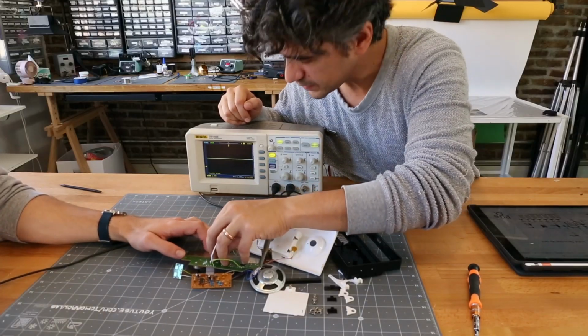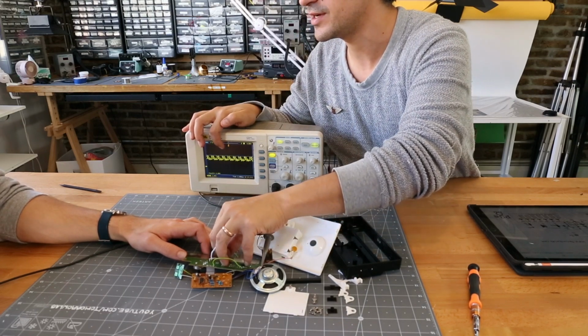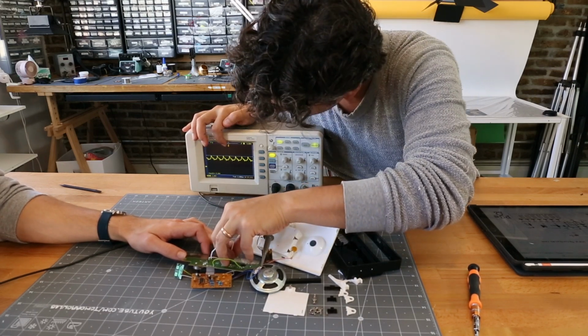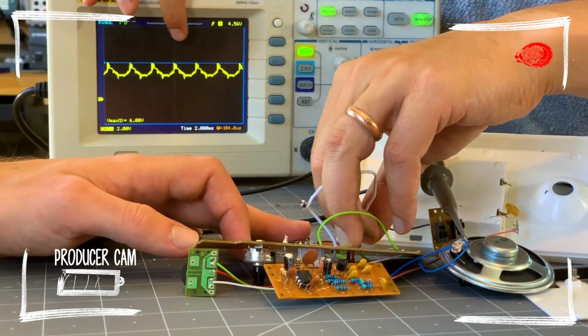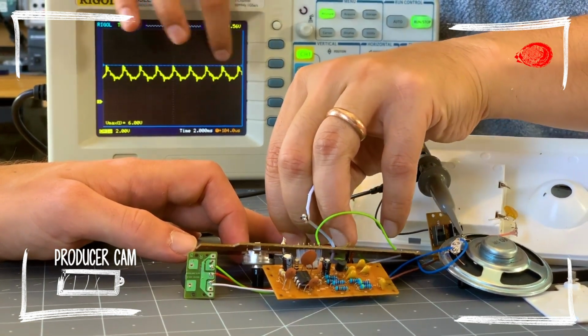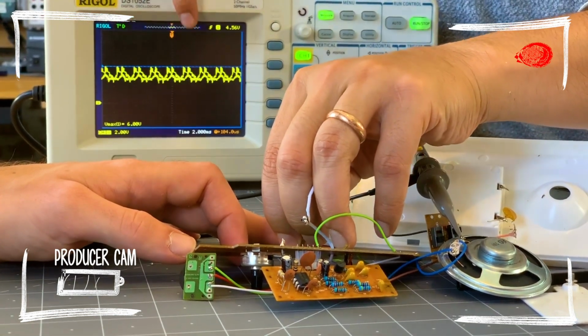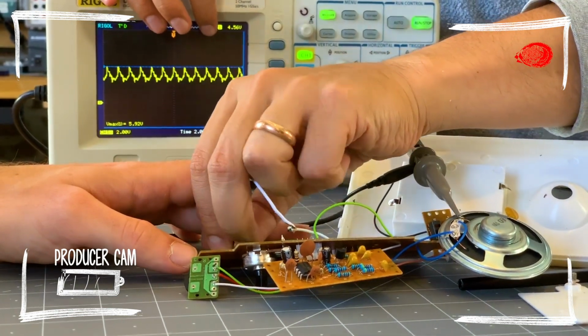Cool. So you can see our waveform here. It really is a triangle wave. It's very, very sawtoothy. And so if we go up and down the scale, you'll see these bumps get closer and closer together. And that's because the frequency is increasing, right? This is a constant time scale, and as we go up, more bumps happen within that time scale. It's a higher frequency.